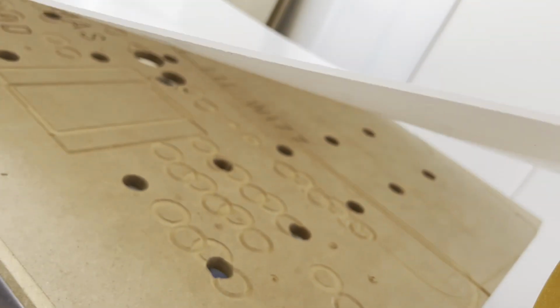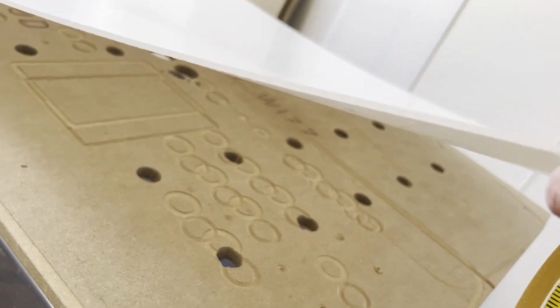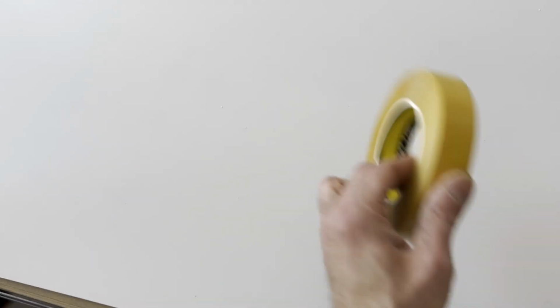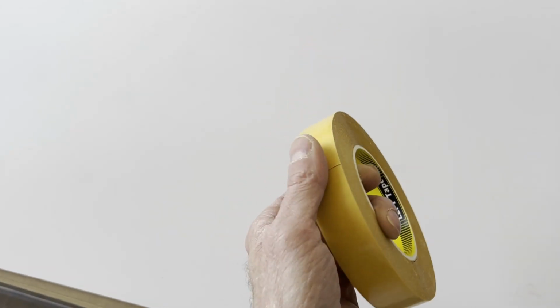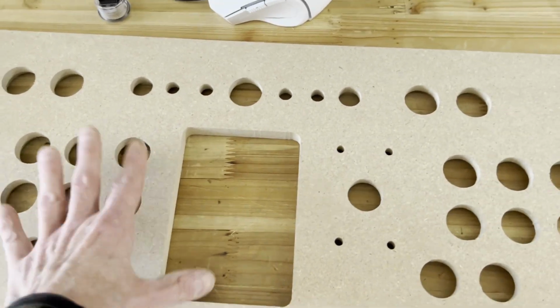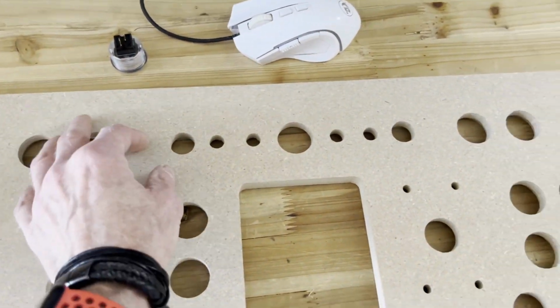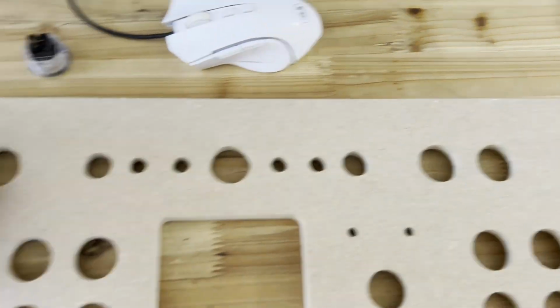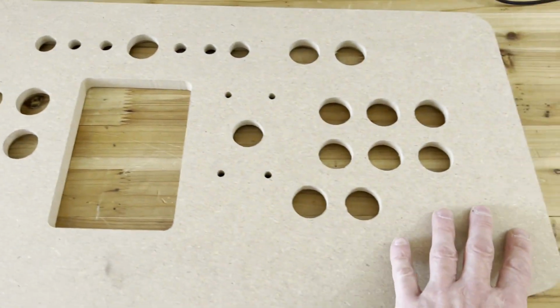So to tape it and make a space, I'm going to tape the plexiglass when I'm going to cut. So the bar is going to be there. I'm just going to put two or three pieces of silicone double tape. It's very easy to remove. So easy like that, and I'm using the same Shaper plan, so that way I'm sure every hole is going to fit perfectly on top. The edge is going to be exactly the same, but plexiglass.